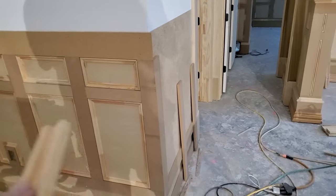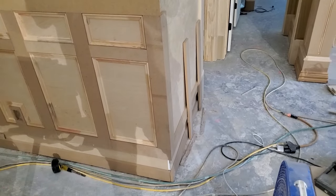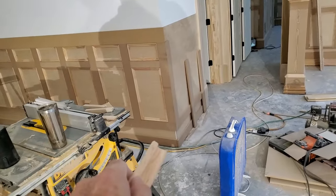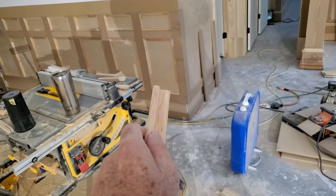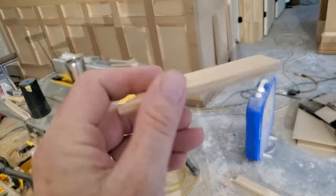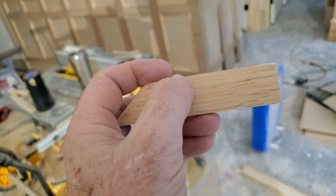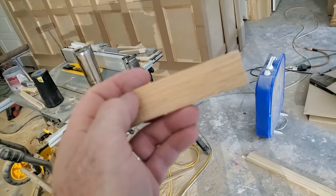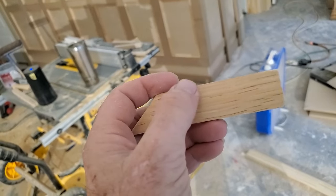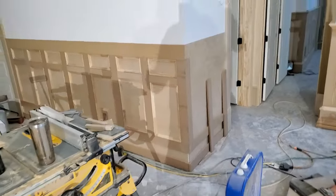And then, like all these moldings, you've got to cut them all. You've got to nail them in, fit them in. When I'm cutting moldings on the saw, I have kind of a fast way to do it. Like I said, I take all my measurements, I write them on the plywood, and I make a cut list. The reason I write them on the plywood is I know, like, if this is 13 1/4 here, and this is 13 3/16 down here, I know where those pieces go. And so when I make my cut list, I write on the back of the piece when I cut it, really quick. And I don't write 13 3/16. I just write a 3 and a slash. I don't write the 16 because you don't need to. I already know that it's all 13. So I just write a 3 and a slash. Or if it's 1/4, I write 1/4. If it's 1/16, I write a 1 and a slash. It's just a little quicker.